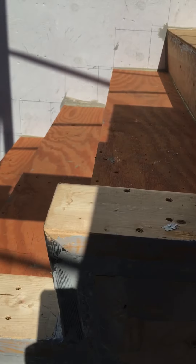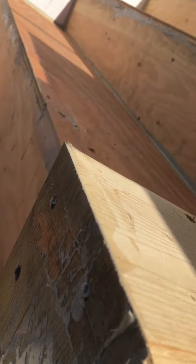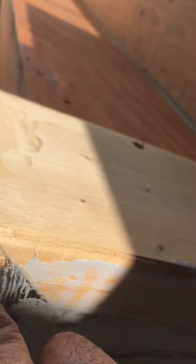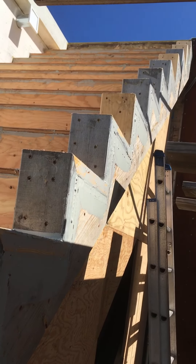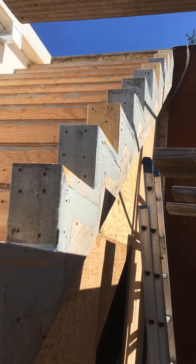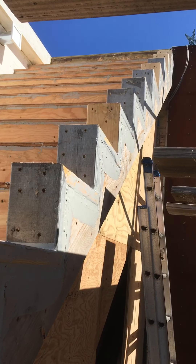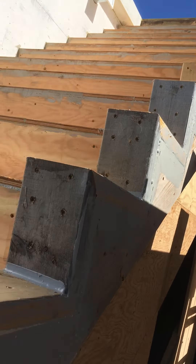In the meantime we're gonna put Henry's emulsion on it and that will keep it weather tight. My dad wanted us to miter these two pieces so we have no exposed end grain, because end grain is what really draws in the moisture, splits out, and makes a mess. So these all got mitered.